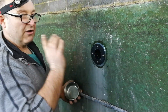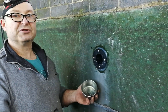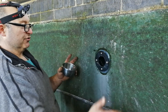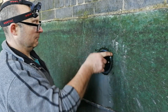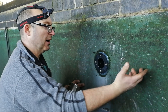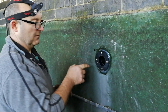Retrofitting them like this is probably not the best way of doing it — if you were building a pond from scratch you can get these things into the wall without going through this procedure. But if you've already got a pond built and the fibreglass has already been done, then this is how I would suggest you go about it. The back of the connector is still accessible and when you're ready to connect your pump you go around the back, insert a piece of pipe, and glue it in place from the back.